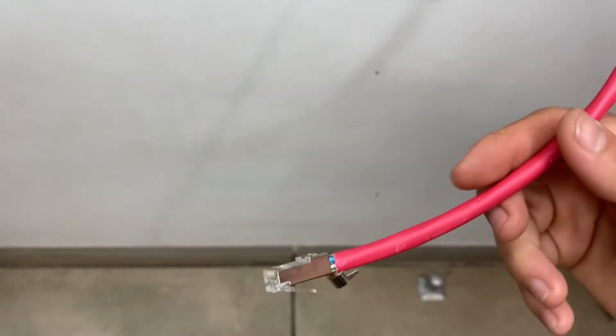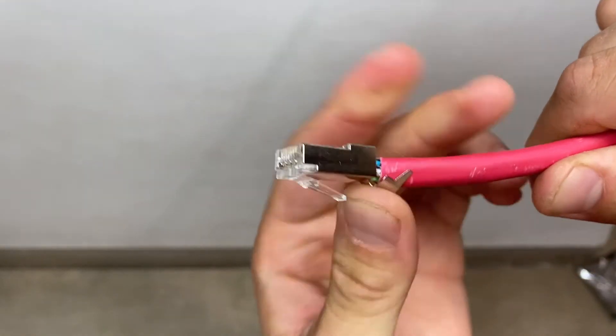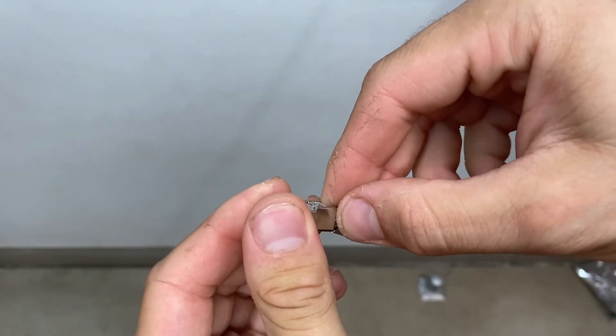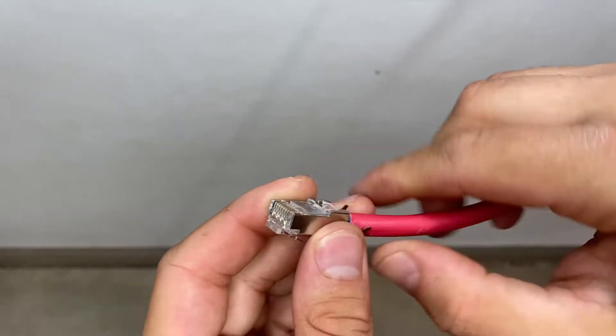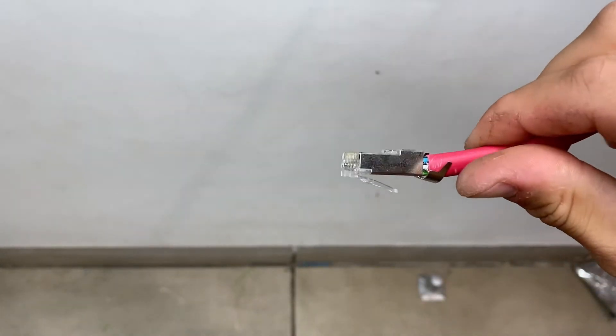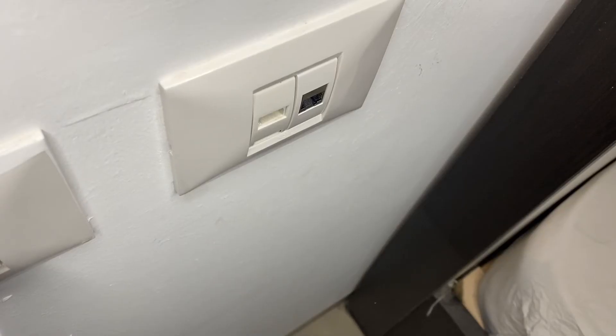It can be a little bit annoying because the cables won't go in smoothly — don't forget it's a Cat 7 cable with fat cables, so do it slowly, don't rush. After the bridge is in, push it until the end so you can see the head of all the cables. Now take the presser and press the connector — it can only fit the presser face down. We just installed a new RJ45 connector on a Cat 7 cable, and trust me guys, that saves you a lot of money. But it's not only about the money — you've learned something new, so that's great.